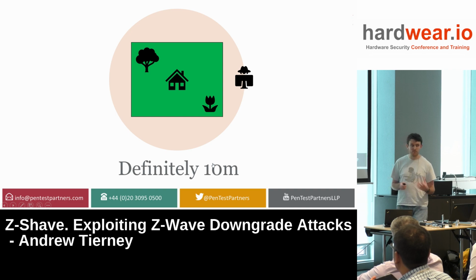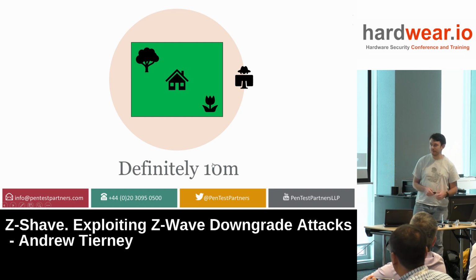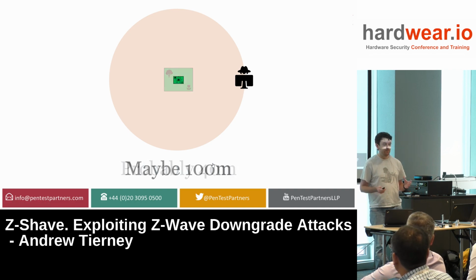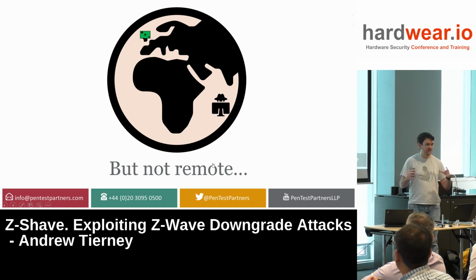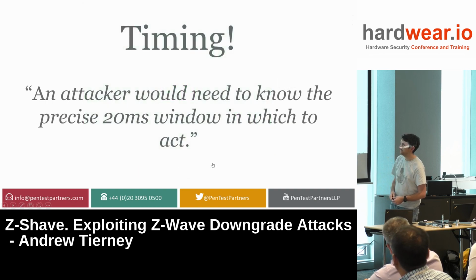There used to be a thing called low power inclusion mode. So when we were pairing this device into our network, it would transmit with low power, but that's been deprecated. So they transmit with full power. So we managed to do it 10 meters outside a house. Now we'd probably manage to extend that to 40 meters. I don't know. We could possibly get that out to 100 meters. It's still a local attack though. What's important, it isn't a remote attack. There's no way for me to do this from the other side of the world. I have to be local to it. But really importantly, it's not so small that we wouldn't be able to do it without entering someone's property. So they're trying to downplay this range aspect of it.